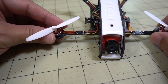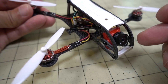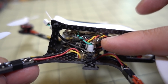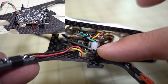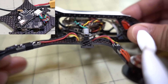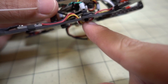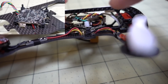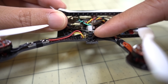Otherwise you would have to extend the motor wires, which is also kind of a hassle. The rest of the parts are the same — you've got the Caddx Turtle there from the Mobula 7 HD, and all the stacked parts. You've got your all-in-one flight controller there, and I stuffed the video transmitter right there between the Turtle and the flight controller. Getting the parts on here from the Mobula 7 frame is a little tricky. You do have to put a long screw that's included with the frame up through the bottom, and it mounts the stack — the flight controller board and the video transmitter.